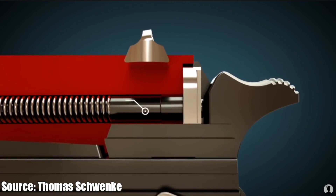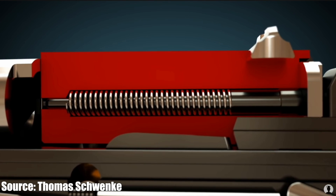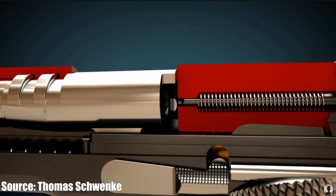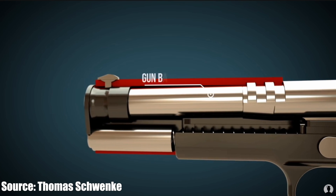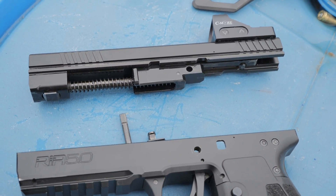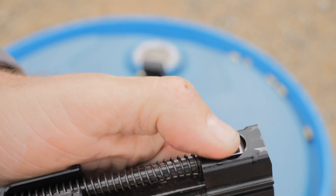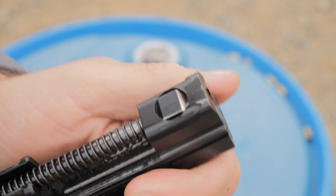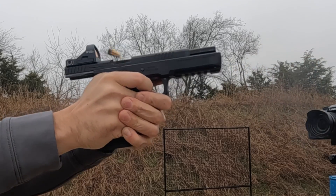There are a number of different factors on why the gun is so weird. The number one most obvious is that if you know much about how handguns operate, they typically use a Browning modified tilt-lock style design where the locking block is right in front of the chamber. So when you fire the gun, it feels like it just lifts up from the muzzle — that's where the force feels like it comes from — and then does whatever recoil is going to do. Now the 5.0 is kind of weird because the locking block is right at the tip of the muzzle. The way it works is the guide rod moves forward upon ignition, which causes the locking block to drop out and then causes the slide to unlock and go to the rear. So you feel this weird bump down at the muzzle before the lift, and it's just very, very strange.